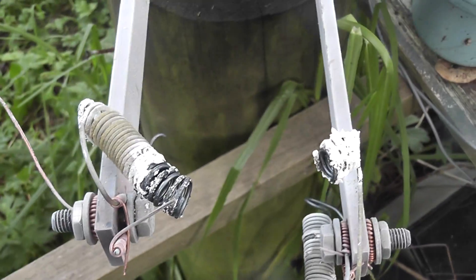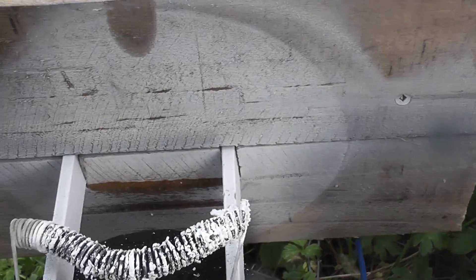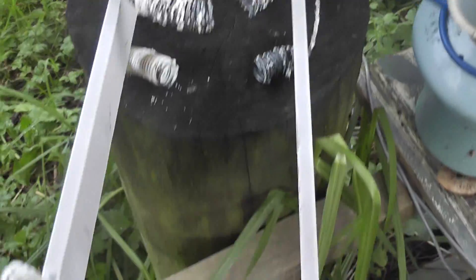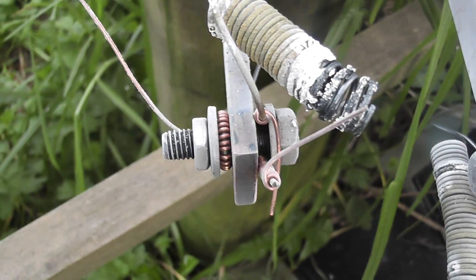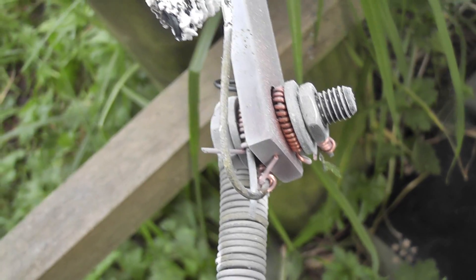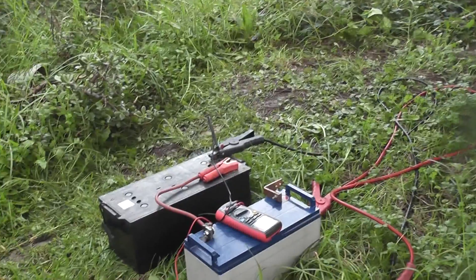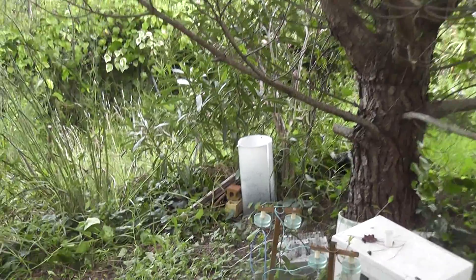A bit of carnage. The heaters de-galvanized themselves. This one element seems to be hanging in there still — that's still intact. Copper bars have a nice coating on them. There's a design flaw on your lead-in wires. Anybody who does high-power heating needs to put copper wire around the ends, otherwise you get hot spots and the heaters will melt themselves clear. Time to pack up the lifting exercise, get these accumulators back inside, and put a video on the tube.